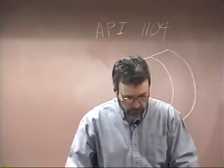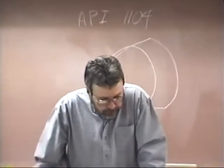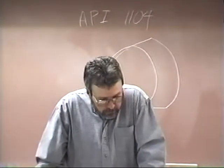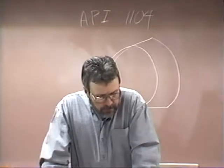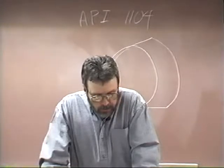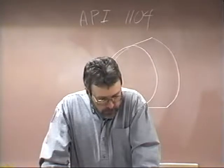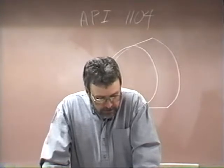Okay, flip the page, 104. Horizontal 2G welding, outdoor pipeline welding, read those topics. Right below figure 8.5, I want to read from your text. It says weld cracking can be a problem when welding pipe outdoors, particularly when welding large diameter pipes having a higher alloy content.